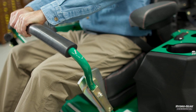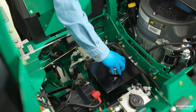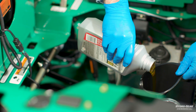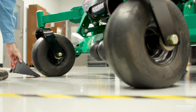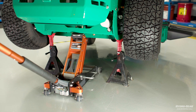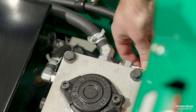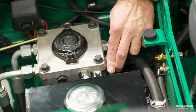We're going to walk you through the purging process. Before starting, make sure the hydraulic oil is at the proper oil level. If not, fill to the proper level with the correct oil type specified in your operator's manual. To purge the system, it's necessary to block the non-powered wheels and hoist the drive wheels up off the ground. Open the bypass valve on each pump by turning counter-clockwise one to two turns without removing the valve completely.